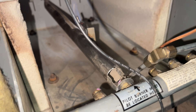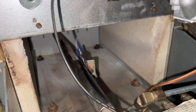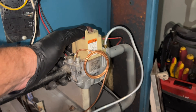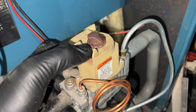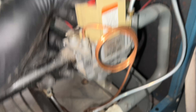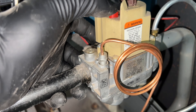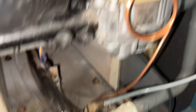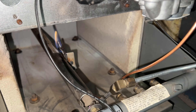New thermocouple is in position. The pilot flame still looks the same color — we may need a pilot burner assembly, but let's see what happens after 60 seconds. Plunger is down — by pushing this down you are manually holding the pilot valve open. There's a spring and magnet: once there's enough millivoltage present to the pilot valve magnet, it will stay open when you release the plunger. If it doesn't stay open, check for voltage. Bad voltage means a bad flame; good voltage means a bad valve.